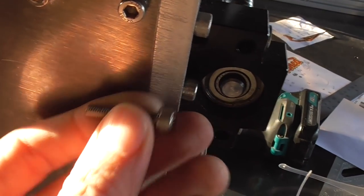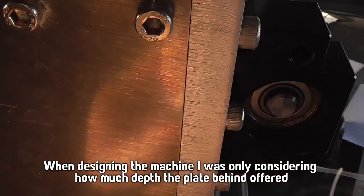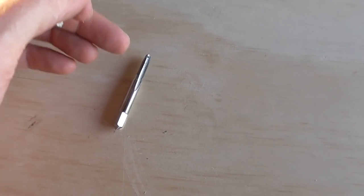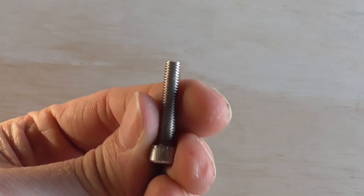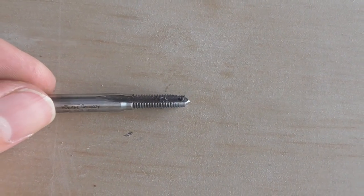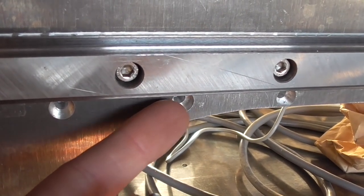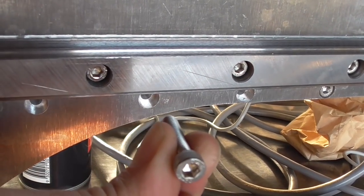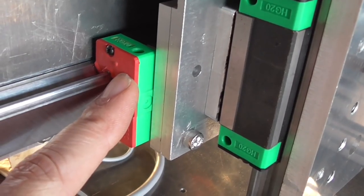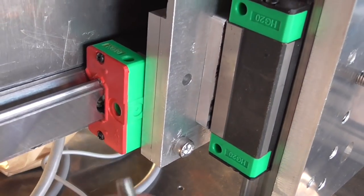All I was really thinking about is how much material we have behind where the hole is going. For these bolts there's going to be 12 millimeters of plate and then another 12 millimeters behind it. When I was making the MDF mock-up I didn't use taps - I just drilled at the normal tap size for aluminium and drove the bolt straight in. So the MDF mock-up didn't alert me to this problem. There's only a certain amount of thread you can make in the holes, and it's even more of a problem where we have counterbores, losing another five or six millimeters.